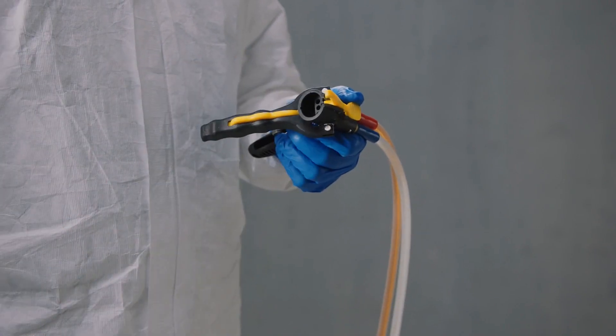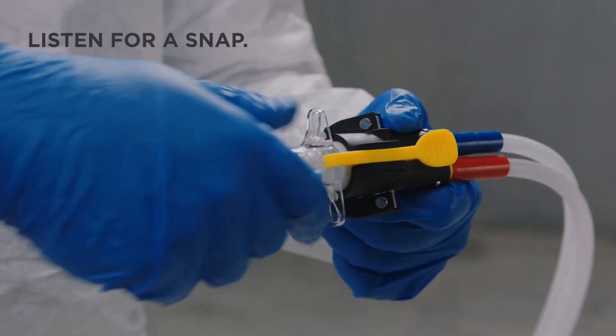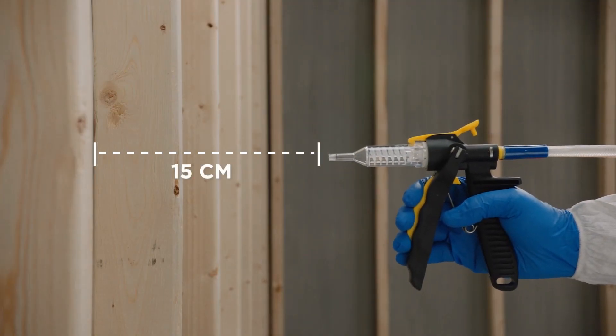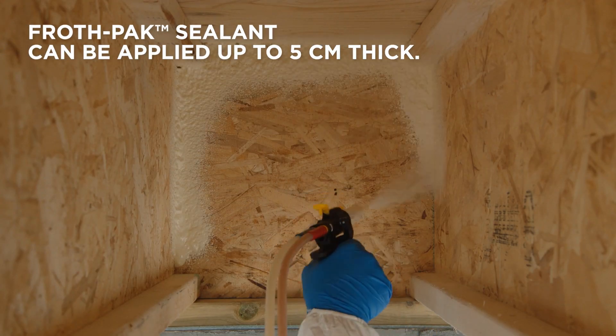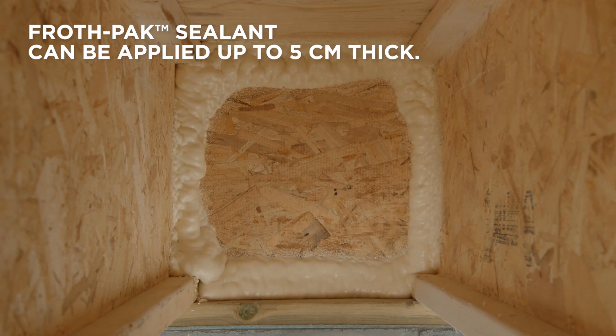Wipe down the dispenser face and apply more jelly. Push the nozzle firmly into the Instaflow Dispenser. Pull the dispenser at least 15 centimeters away from the spray area and fully engage the spray trigger when you're ready. Move in a steady stroke around the joist. Keep in mind that the foam cures in 30 seconds.